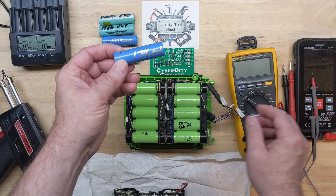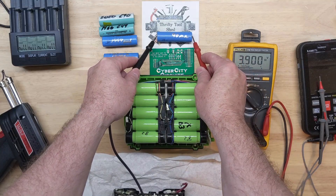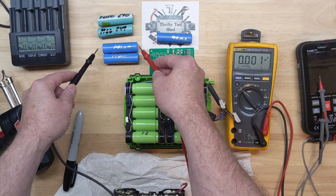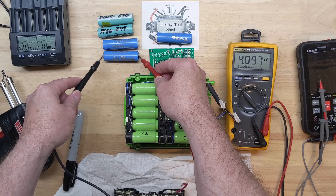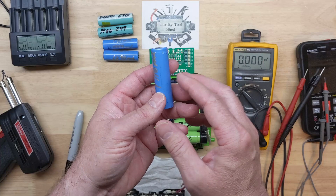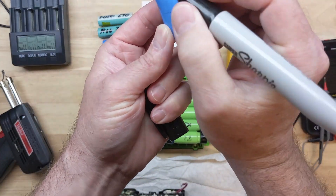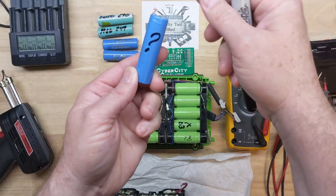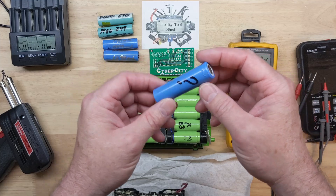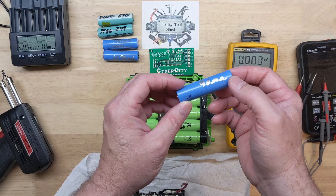These cells came out of the DeWalt pack that I tested a few months ago. With this lower capacity one I expected it to be down — and yes, it reads 3.9 volts while the others are at 4.15, 4.13, and 4.1 volts. So I would definitely not consider that one for a battery pack. Sometimes these will still make a good flashlight battery as long as they're not dropping off too much. I'll put a question mark on this one — if it drops down more the next time I go to use it, I'll just recycle it, because you don't want your flashlight to not be ready when you need it. Any that are dropping down, I'll recycle — their capacity and life have really been diminished to the point where they're not very useful.